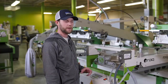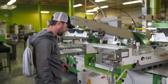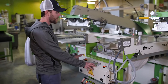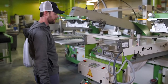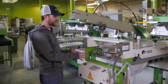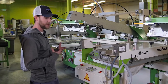Now that I've got the machine all hooked up and my test shirt is printed with adhesive, I can go ahead and verify that the machine is working correctly. I've got my electrostatic generator on, I've got my flock on, everything is set — I'm just going to hit the play button. On the first test print, I always like to do it twice to get a little bit more flock down than normal, just to verify that everything is getting good coverage.